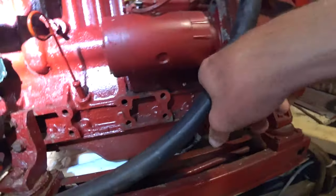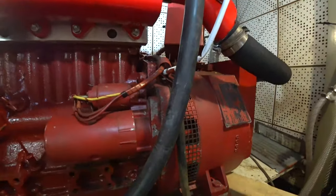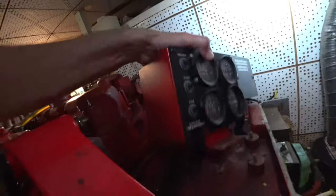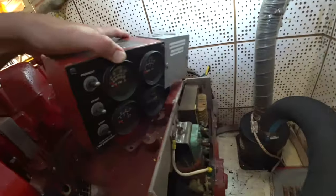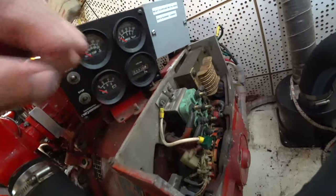We're making some pretty good progress tearing this puppy apart. I've taken the two bolts out for the starter, but the starter is pretty much frozen to the back end of the generator—I've got to give it some finesse to get it off. I've disconnected the control box from the top of the back end housing—just four bolts there. And I went ahead and disconnected the main electrical connections on the back of the unit and pulled them out.